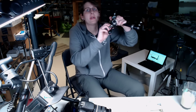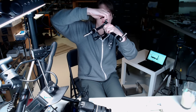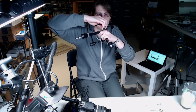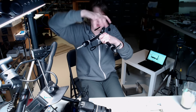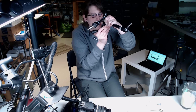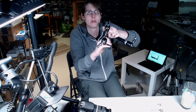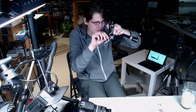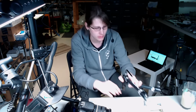So there are two ball bearings on this thing. There's one set on top, which is just like a thrust bearing. The races are uniform. Just got a bunch of balls there that can handle a lot of force this way, while simultaneously turning so that you can actually adjust it while it's tight. And then on the bottom, there's a totally different contraption that's also full of steel balls. And this thing is super nerve-wracking because it always feels like it's gonna spill balls everywhere and I'm gonna lose them forever.